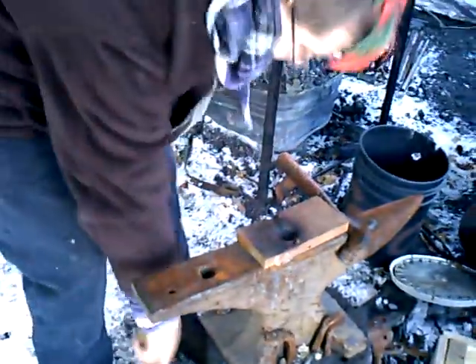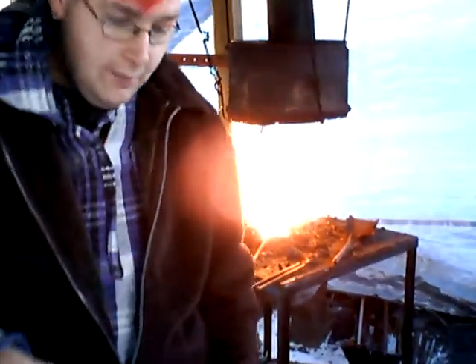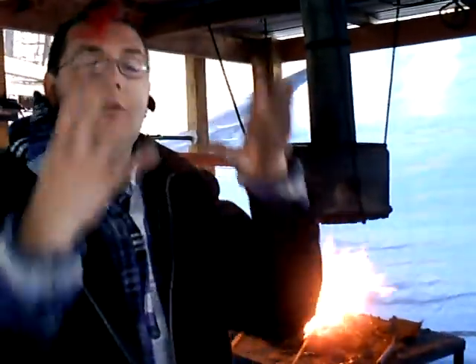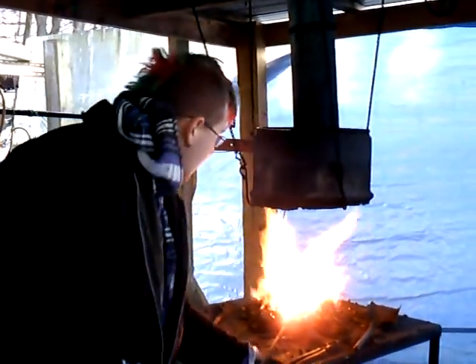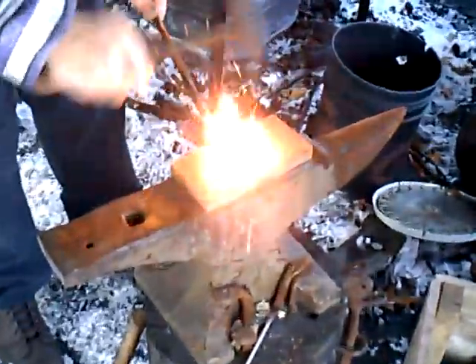Now here's what's very important. Some smiths have the veins up and some have them down. What I do is I want it to curve and project those veins out. So I'm going to heat up my piece, put the veins down in the mold, and hammer from the back. Now it's going to make some smoke and some flames, and it looks really cool for demonstrational purposes. And you see how it gives that nice curve effect right here — look at that. That's perfect. I love that effect.